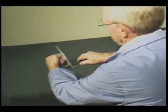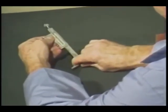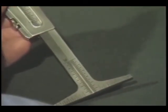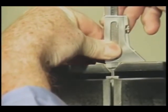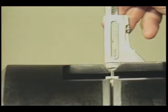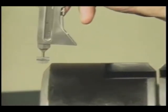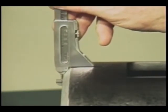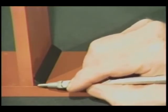This procedure can also be used to verify a 37 and one-half degree bevel angle. Before you insert the gauge, be sure to set the alignment scales to the zero position. Now place the gauge body squarely against the pipe wall and push the gauge as far as it will go into the fit-up gap. If the beveled shoulders on the gauge fit snugly against the bevel on the pipe end, you have the correct 37 and one-half degree bevel common to most pipe end preps.